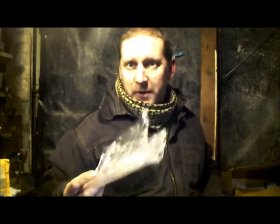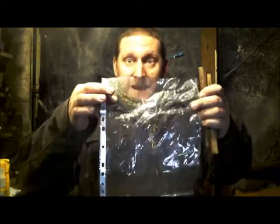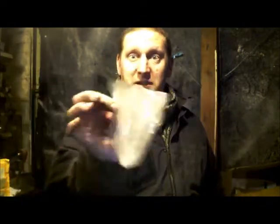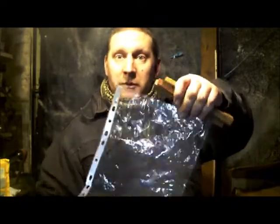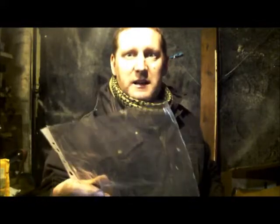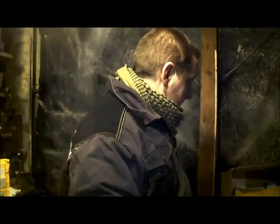You might get 100 for a pound, okay? And what I was considering was I wrap it up in it and I sand it off as it's all glued to hell as a big thing. So it's easier than greaseproof. Drop it in the bag. Fold it up. Put it in a vise, bench vise. So it doesn't get glue all over the place, it's inside here. But when I drop it out, put my hand in, it just pops clean off. So the glue doesn't stick to this plasticky, shiny stuff.